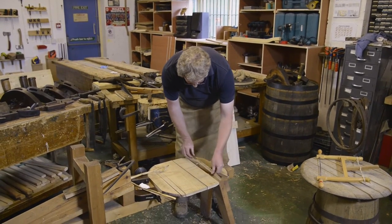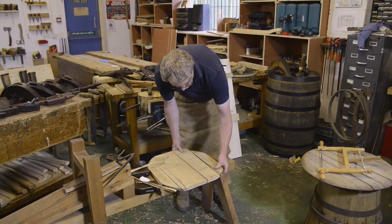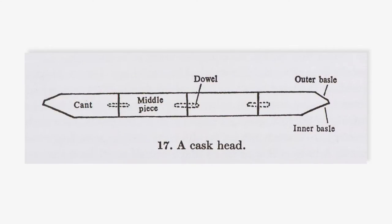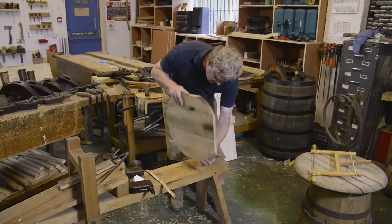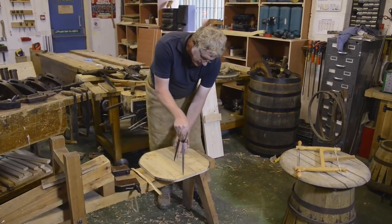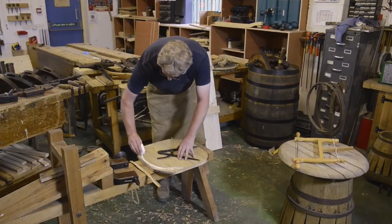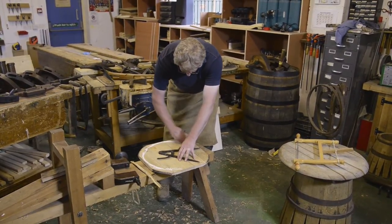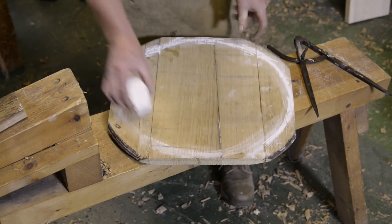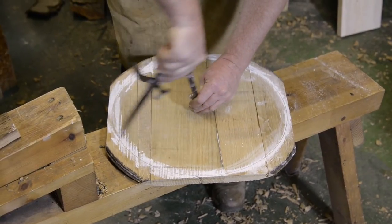The reed can be placed over the dowels. The middle parts of the head are actually called the middles, and the two end pieces are called the cants — these will all be locked up together. We're going to draw our circle using our compass. To help us see the line more clearly, I'll chalk the outside edge of the timber and then redraw the line — it's far more visible.